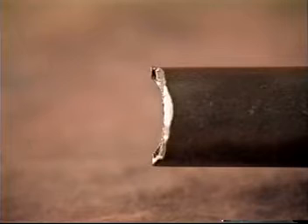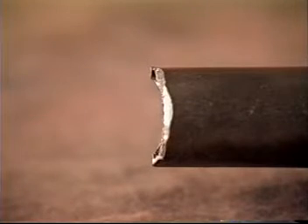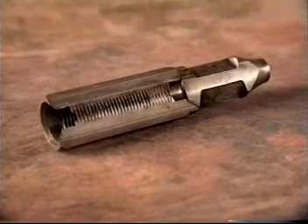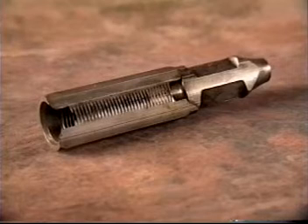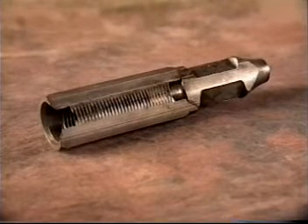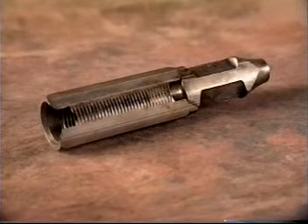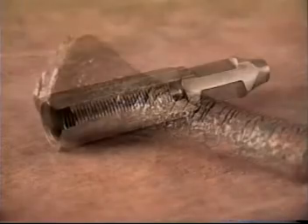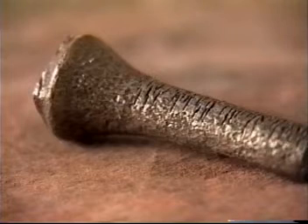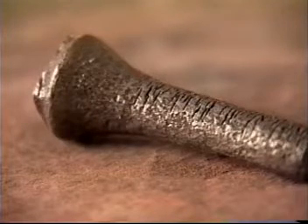This configuration indicates a double shear lip break face and is the result of unidirectional bending. A unidirectional bending failure means the rod string failed under a compressive load. Compressive loads will usually result in distinctive wear patterns on the couplings as well as the sucker rods. Look for longitudinal wear patterns that completely erode the walls of the couplings and the rods. Compressive loads also cause transverse stress cracking due to flexing when the rod buckles on the downstroke.